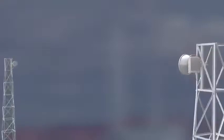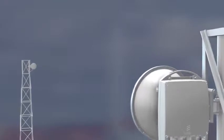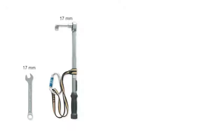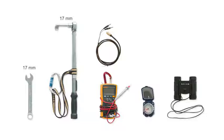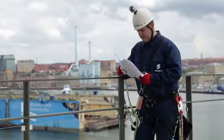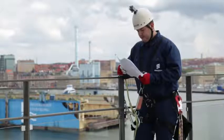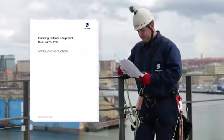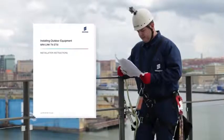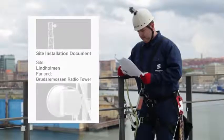To align this 0.3 meter single polarization Minilink antenna, the needed tools are a 17 millimeter spanner, a torque wrench with 17 millimeter socket, a voltmeter with a test cable for the alignment port, a compass, and a pair of binoculars — handy when seeking the direction in which to point the antenna. During outdoor installations, follow the safety regulations for work at height. The installation instructions manual is useful to have at hand as reference, and the parameters for the link are printed in a site installation document.